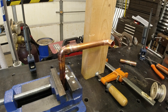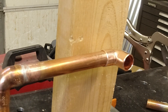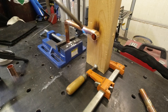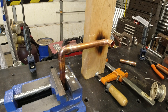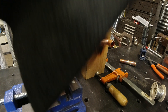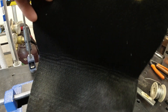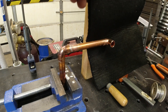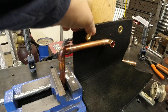You're occasionally going to run into the issue of having a pipe right next to a board. I've mocked this up here, and you can see the issue — when I heat up the fitting, I'm burning the board. So don't do that. They make these little plumber's mats you can buy for probably around $10. You set them behind the area that you're trying to sweat.